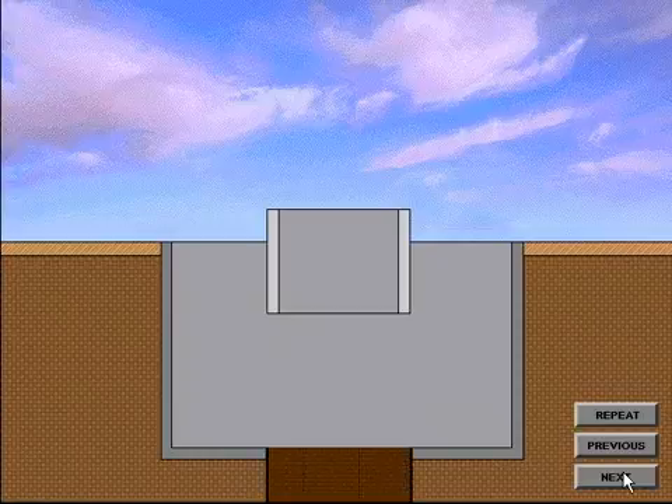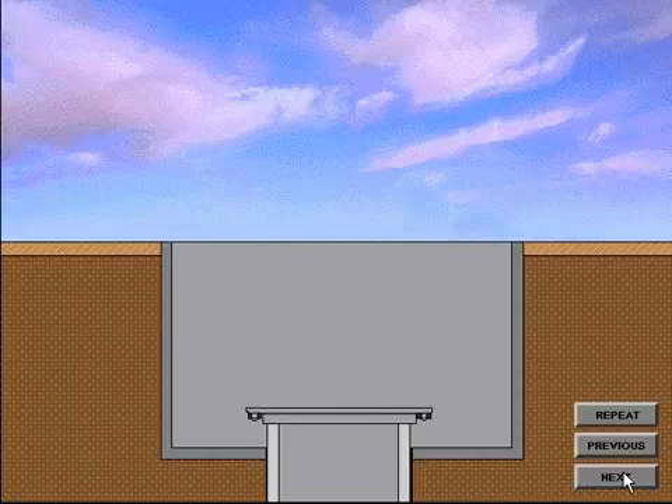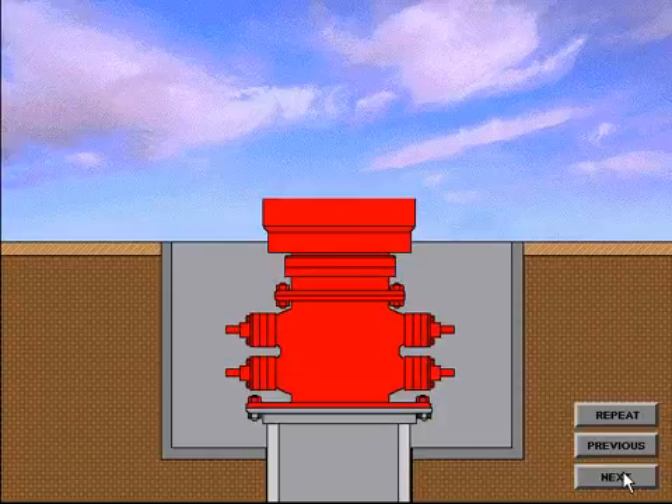To begin, a large diameter hole is drilled to a specified depth, generally relatively shallow, such as 100 or 200 feet. The pipe is driven into the ground to a specified depth or to the point of refusal. In most cases, an adapter flange or a drilling flange is welded to the conductor pipe as a means to connect a diverter system or blowout preventer system.